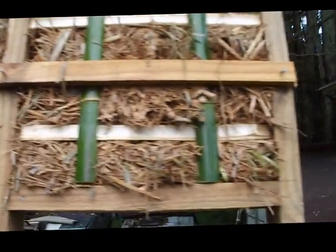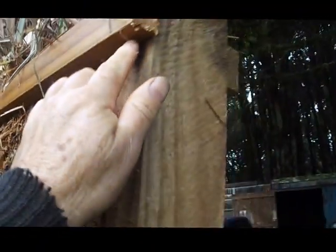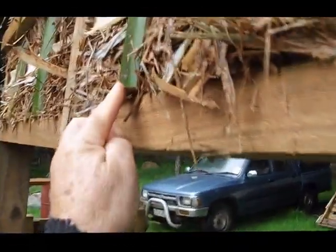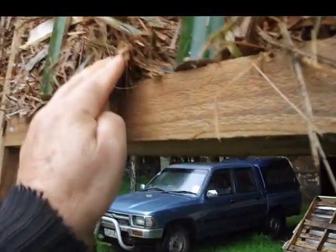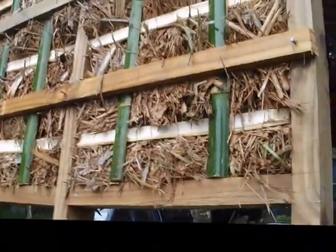and it's occurred to me that I can improve this technique by putting shuttering between these 1-inch battens here, so that will not occur. The actual bamboo slats will be held tighter in the frame, and there'll be a board here so that this won't poke out on the bottom when I'm infilling, horizontally infilling on the ground. So we're going to do this one again. It hasn't turned out too bad, but I can see there's room for improvement there, and so we'll see how that goes.